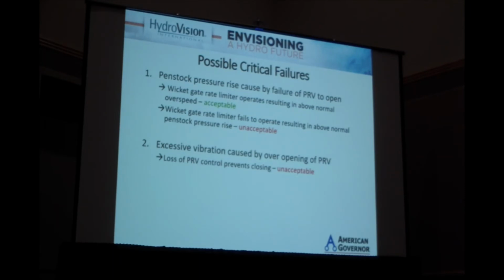Usually they're acceptable, and you can put relays in fail-safe configurations and decide whether you need a closed contact or an open contact. But sometimes it does get more complicated than just that. And that's what we were looking at here, where you had a little bit of a hesitancy to touch the system because you had known and designed failure modes, and now we're looking at new failure modes. So we went through a rather thorough FMEA on this.